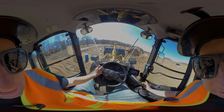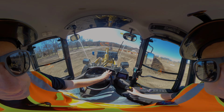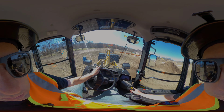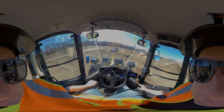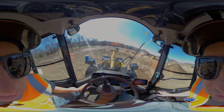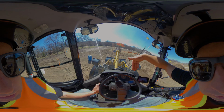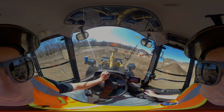The other way you can do it, if you have really rough material and you're trying to get more of a rough cut in there. Same thing, put it down flat. But this time, instead of using the bottom of the bucket, I'm actually going to use the blade edge. So I'm going to roll it. Now I'm actually using, you can see behind it. You don't want to roll it all the way in. You get in trouble there. At about a 45-degree angle, I can see behind that blade.